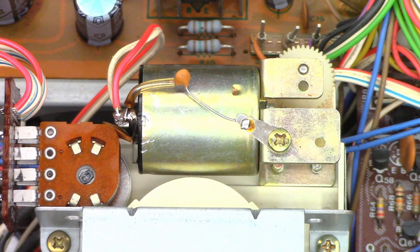What about the other pots? Remember the balance? Yeah, that's bad - a lot of crackles. Treble - just as bad. Bass - oh yeah, that thing needs to be cleaned really bad. Let's go ahead and shoot the other pots with some Deoxit F5.